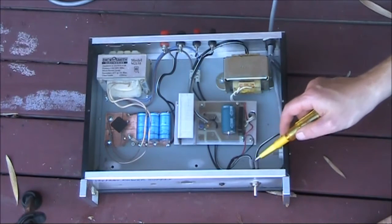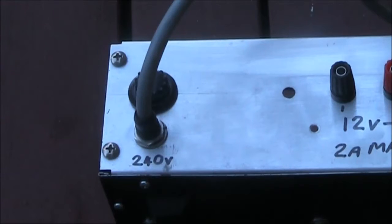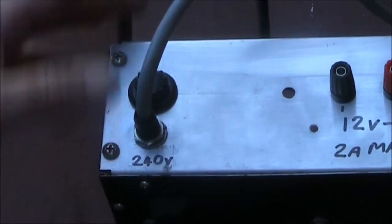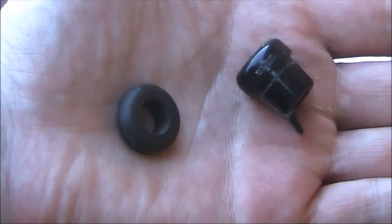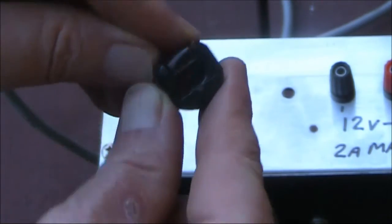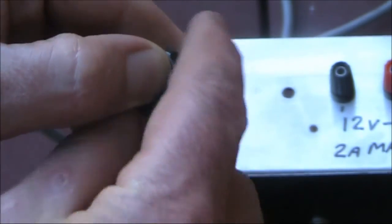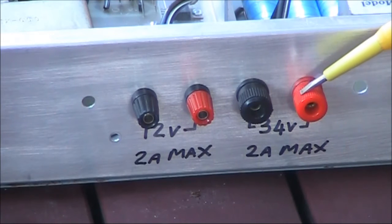There's a fuse, a power switch, and really not much to it apart from that. Looking at the mains cord entry, the important thing is that the cord has a degree of anchorage so that if the rig was pulled off the desk or the cable pulled, the connections don't come apart inside. Some equipment used to use a grommet, which isn't really recommended as it doesn't give proper cord anchorage. A better option actually grips onto the cord — you drill a hole in the back panel, put it in, and cord anchorage is provided by the pressure between the mounting hole and the cord.